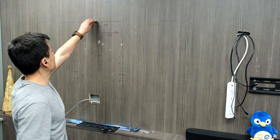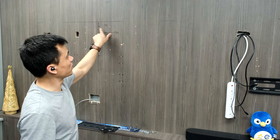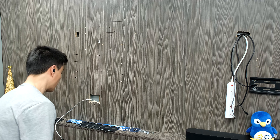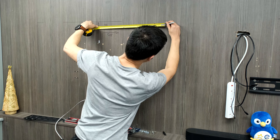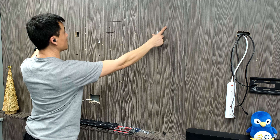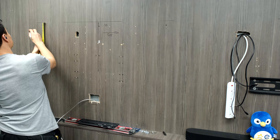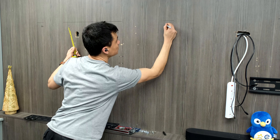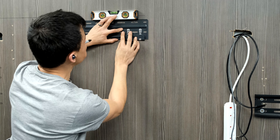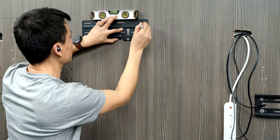From the center line on the wall, I go 51.5 centimeters each way to mark where the holes will be, and 3.5 centimeters down to the center of both slots — that's where the top of the TV line sits. I'll mark 51.5 centimeters across to the first slot and the same the other side, then 35mm down. I'll put two crosses, then put the bracket up roughly there with a spirit level on top to get it level and mark the final holes.